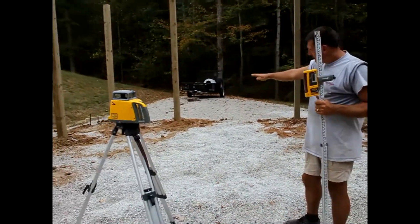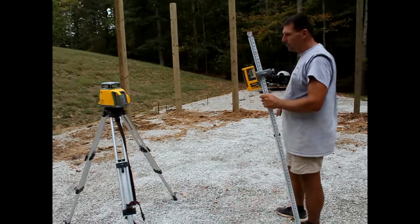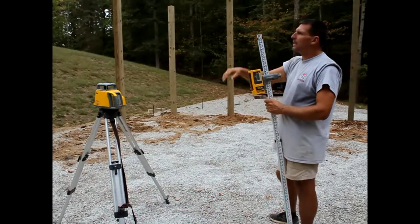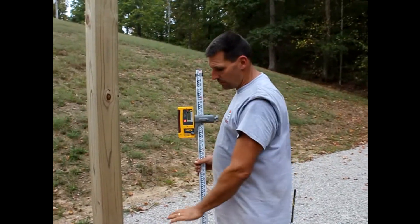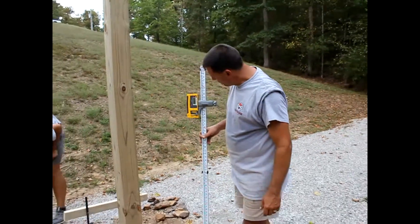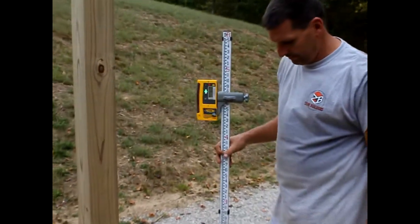What we're going to do with the laser is find exactly what grade we want to start our bottom board, which is what we call the skirt board. The skirt board is going to go in perfectly level, so from that point all the way through the job, I can measure everything from the bottom all the way to the top — using that skirt board as a reference. It becomes my benchmark. We want to start at the high corner so we're not digging down to put in our board. Right there — that's my benchmark.